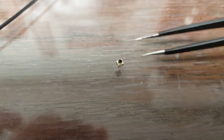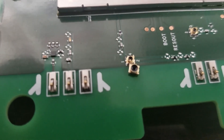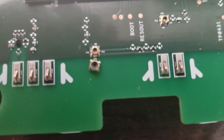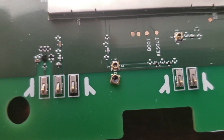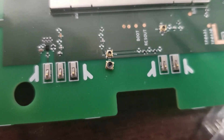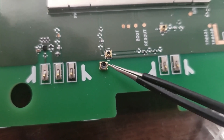Here is the MHF SW23 connector directly from IPEX. I'm going to place it next to the one on the T-Mobile router board. As you can see, they're quite a bit different — not even close. The diameter is wrong, which explains why I could not fit my SW23 to SMA adapter onto the router. It's just a different diameter, and a different depth it looks like. Of course, this one is not soldered here, so it might sit a little flatter, but yeah — completely different.